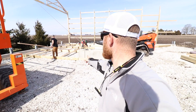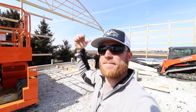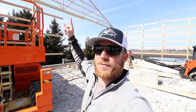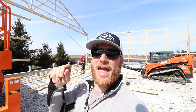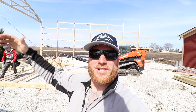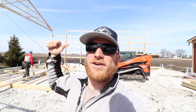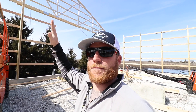We've got this block in — you can see the concrete block right out here, and that's what we're chaining right now. The last column we've got built — it's not the peak column, that's the ideal column we want to chain back. We're going to go ahead and stand this last wall section up. Now that we have the truss in place, we'll get everything fastened and nailed off. Then we're going to spend a lot of time bracing, getting the building locked down, as straight and plumb and strong as possible before we start putting out trusses. You can start whipping out trusses and feel great, but when something's wrong it's going to take a lot of work to fix. If you can straighten the building now as you build out, it will be straight when you finish. So if you're ever going to do a large truss building, do as much work on this first truss as possible — get it straight, square, plumb, all that good stuff. Then start working.